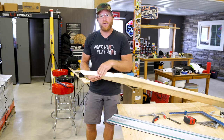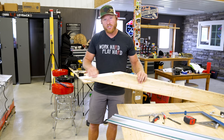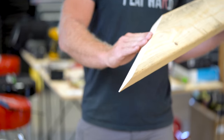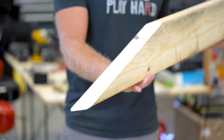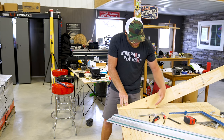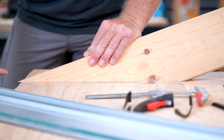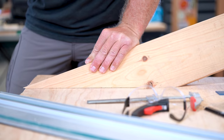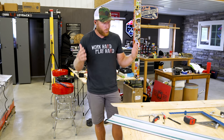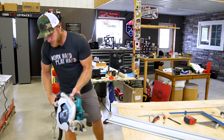There you go — that is one of the biggest advantages of having this saw on my site. I love precision and efficiency. You can see how quick and precise it made the cut without any effort. That's going to allow somebody without a lot of skill cutting bevels with a circ saw to make a really good cut. When I'm doing a rafter or a layover jack rafter I want it seated perfectly on the roof — the more material touching, the better it distributes weight and fastening. Rough framing doesn't have to be rough.